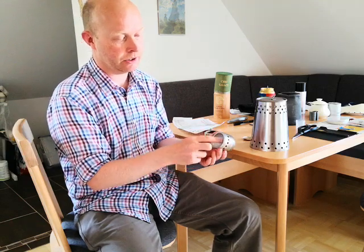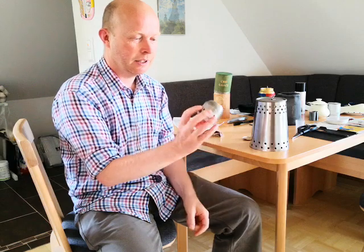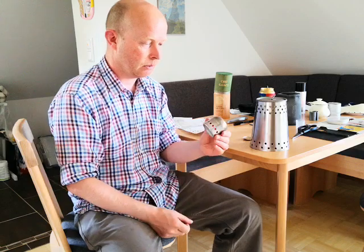One thing to note here, you'll notice I've kept all my glue seams here. So there's glue on the bottom and there's glue at the side. There are some designs that have glue around here. If there's glue under the burners, even though it's what they call high temperature epoxy, this JB Weld, it oxidizes and it gradually fails. So if you're looking at any design that's got glue around the top, my advice is it's probably going to fail. You need the glue down here where it's not as hot, then it will hold. This has been literally engulfed in flame thanks to this red spirit, and still in good shape. And of course, being an aluminium beer bottle, it's a bit thicker, so it's quite secure.